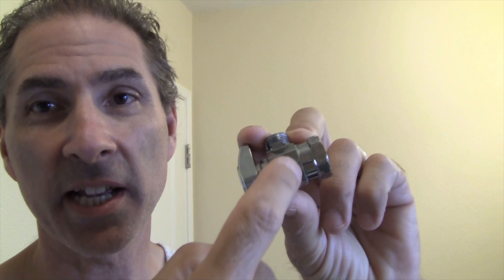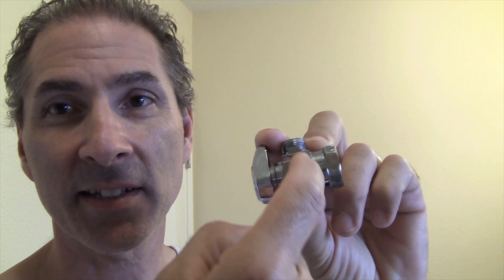Today's job is going to be fixing — or in this case, we're going to have to build a brand new drawer for the vanity. We're currently standing in the second floor restroom of my home, and what happened was we had a water leak here at the sink level. There are two angle stop valves for the sink, and this particular one feeds the sink on the left and does the cold water. The valve body cracked somewhere in here, and water was just spraying out.